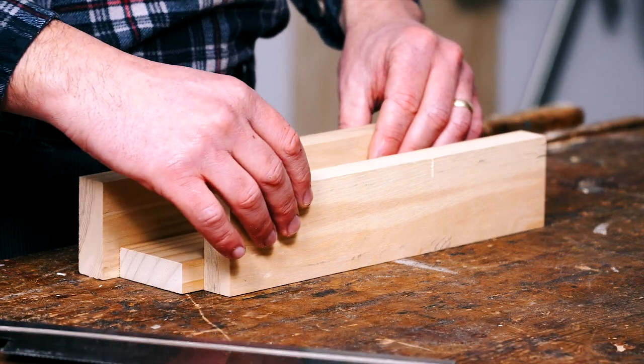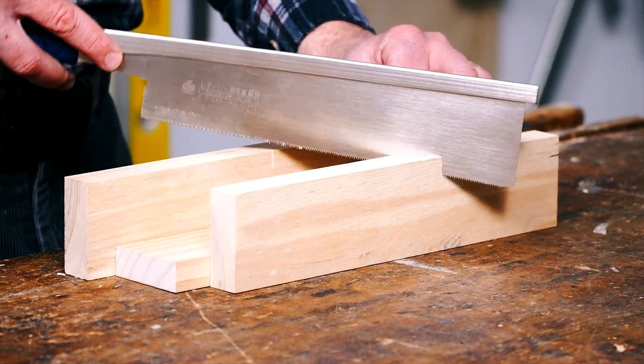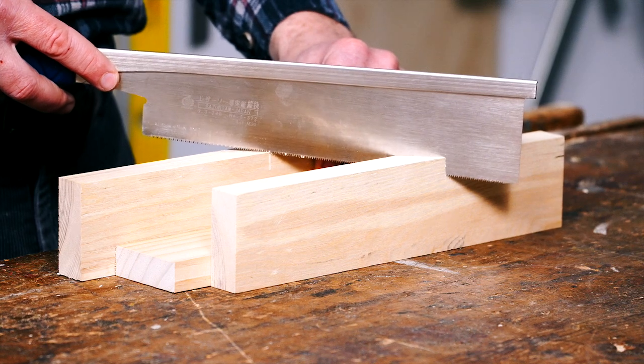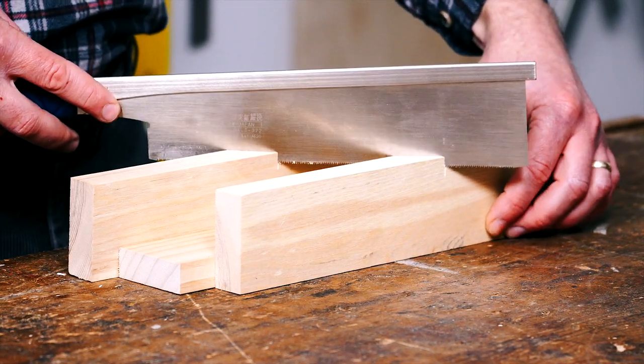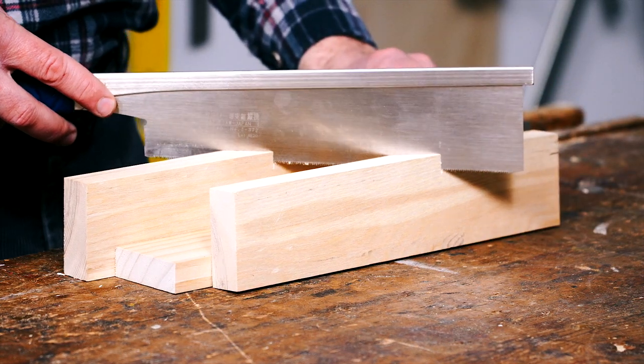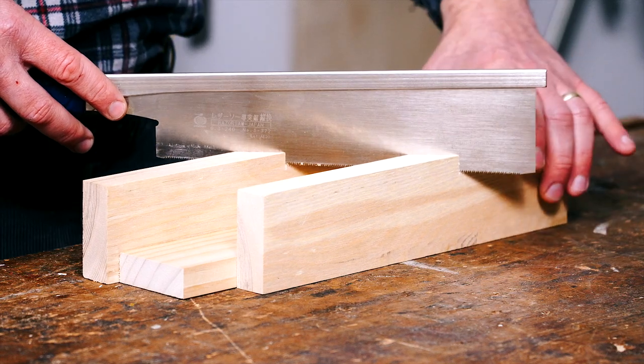You've got a nice line but unfortunately when you open the pieces up they no longer line up. So you're going to have to offset them — but what I figured was I'd use my Japanese saw as sort of like a straight edge. I know it fits into that kerf because it made the kerf, so I'm just going to gently put it in there and that will get those side pieces to register together, and then I'll just glue those to the base piece.